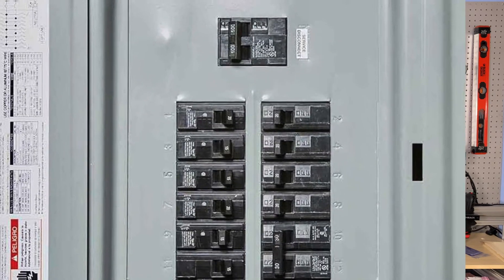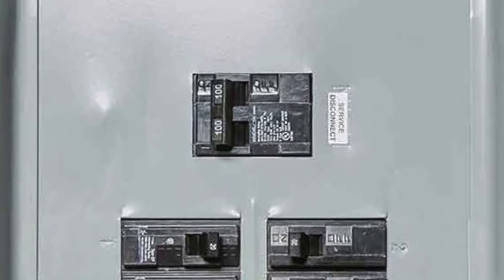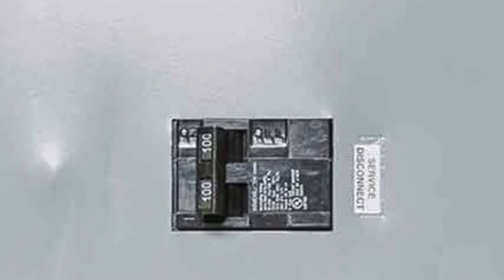Before you actually go ahead and do that, make sure that you turn off the main breaker for your panel — that's the one that feeds the power into the panel from the utility. It's super important that you turn off this breaker before feeding any electricity to your panel, because it would be very dangerous for two main reasons. The first reason is that if you don't turn off that breaker, the electricity you provide is going to flow past just your own local home and start feeding into the electrical grid.